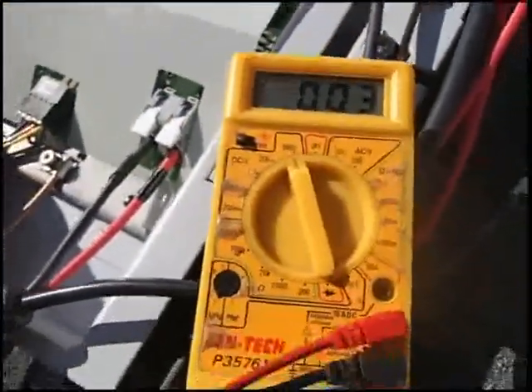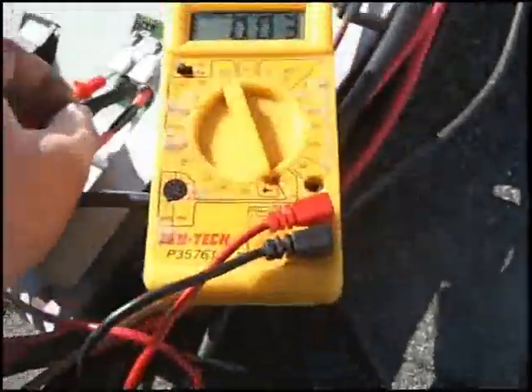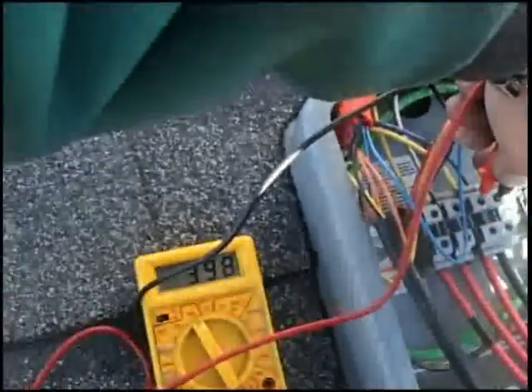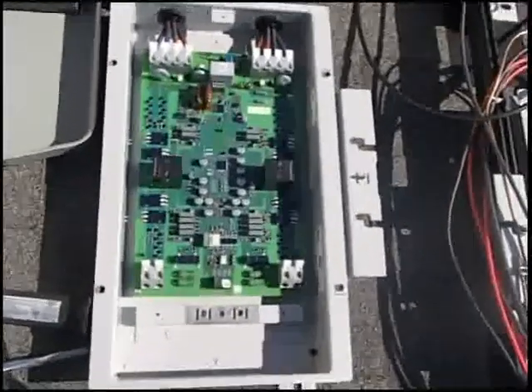On this side, power is not coming out — showing zero volts, two volts, three volts. Power in to shutdown... staying on three even after I pull it out. Interesting. Now it's settled down to zero. Let's make sure everything's cool — yep, 400 volts over here. Now I'm going to swap this rapid shutdown out and put in this one that I obtained from my sister, which SMA replaced previously.